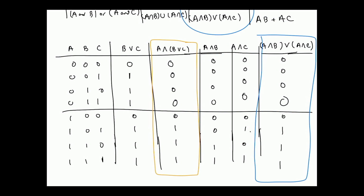So if we have two statements that we suspect are equivalent, we have the rules of Boolean algebra that will allow us to simplify. But if we're not convinced that two things are the same, we can always sit down and do this truth table thing. Now, if I have 1,000 inputs, how many different patterns are there for the inputs? 2 to the power of 1,000, which is a very large number, okay? Which then it's not possible to do this by hand. Fortunately, we invented computers, okay? Although that is maybe putting the cart before the horse here, because if we're talking about how to build a computer, we can't then use a computer to help us build the computer. That's sort of circular, but yeah, okay.